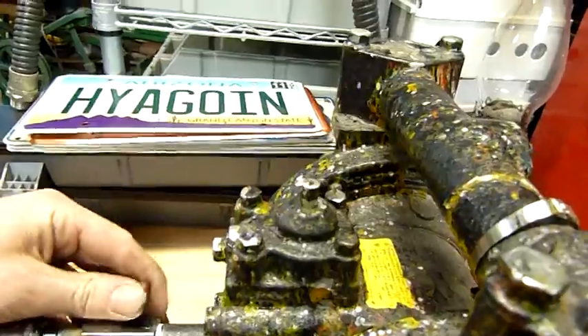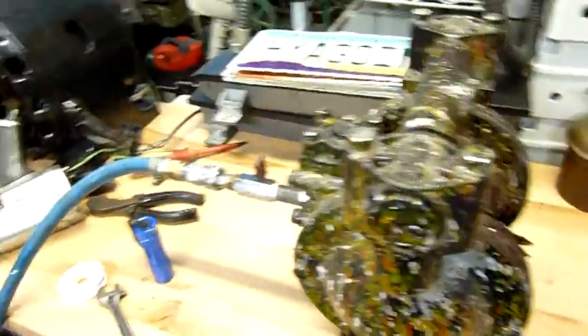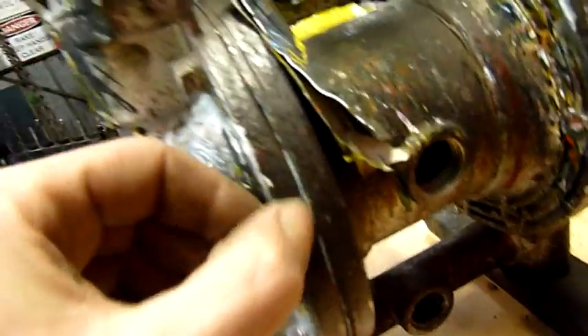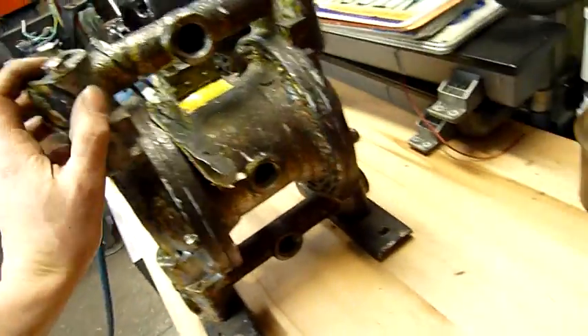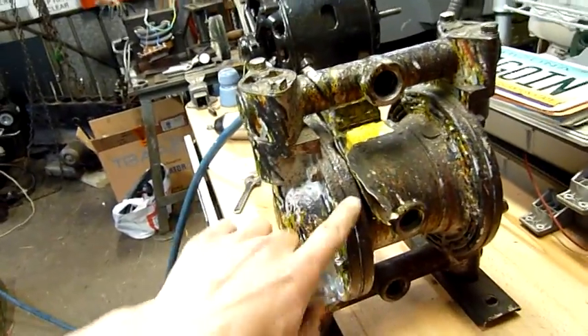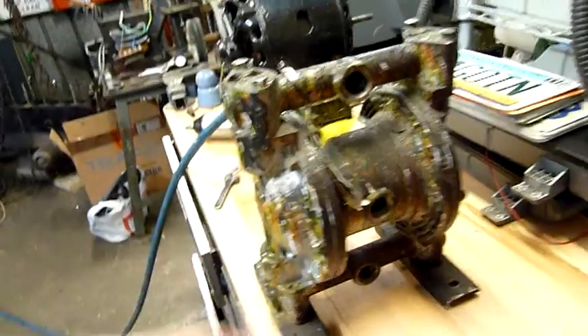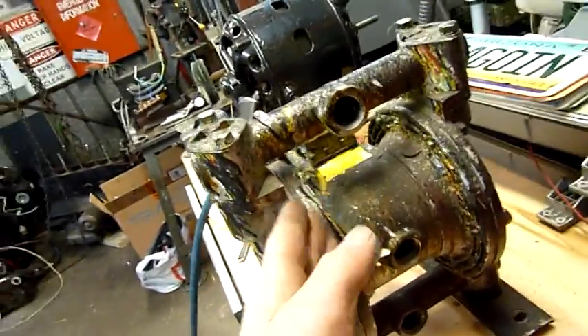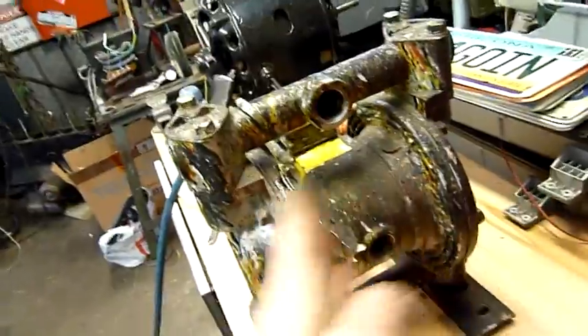This pin pops up as soon as it starts and it looks like it's had paint and stuff getting down past it, so I'm wondering if that's related to it. Yeah, it's part of the valving — the valving seems to be working. I'm just going to blast a bit of inox in there and lube up this mechanism and it should be fine. If I take it apart I'm going to end up breaking the seals. See, there's a rubber diaphragm with a Teflon skin — whatever is exposed to the chemical that went through this, which has a slight smell of thinners, would destroy the rubber. So if I start breaking gaskets, this thing is going to leak. It's essentially got two diaphragms and this piston pump just moves back and forth under pressure differential.